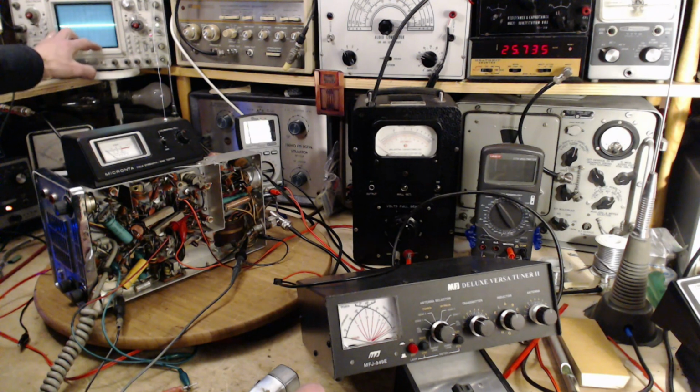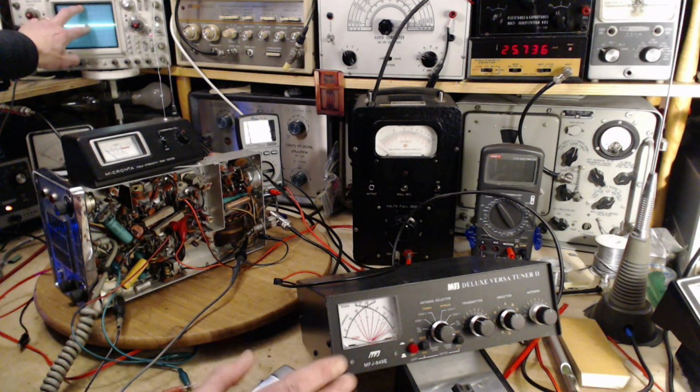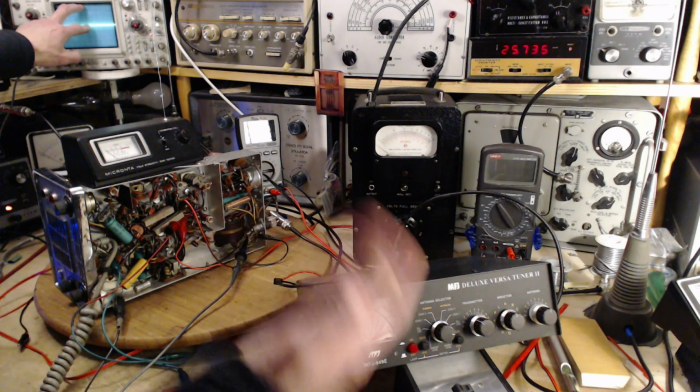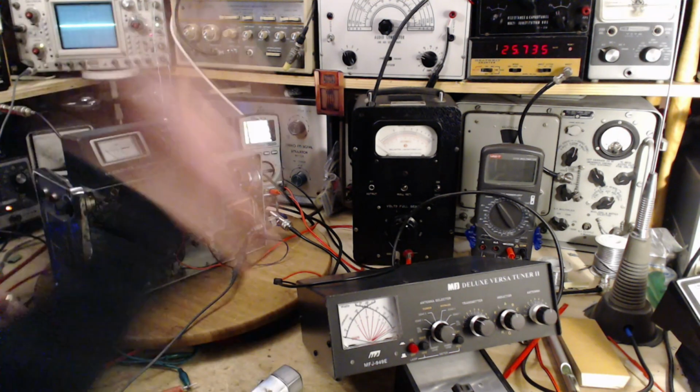Okay, things are adding up pretty good. Now we can calculate the other way. If we are actually getting 12 volts, it's not going to be 12 volts RMS. So you've got to get about 0.7 of 12. What would that be? 9? Let's say 9. That's really close to 7. Great. So we have 9 volts across 50 ohms.